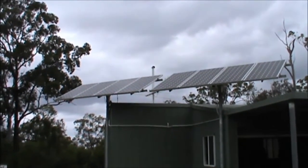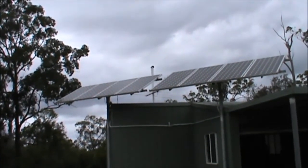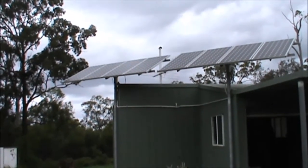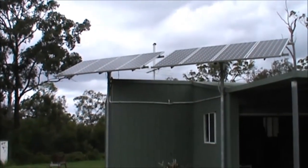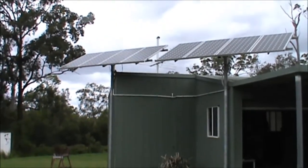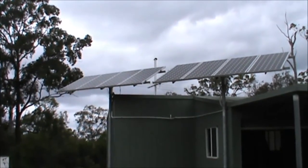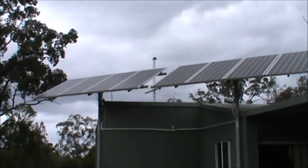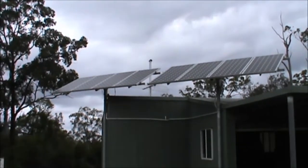You can also see in the background there that it's quite cloudy, and this is a problem with off-grid solar systems — they're not operating at their maximum efficiency. The integration of off-grid power in homesteads means you've got to watch every bit of power you consume with the appliances you're using in your home. In this case John here's got a backup generator; they've had to use it for the last three or four days because we've had rain. On cloudy days like this you will get some charge off the panels but they're not operating at their maximum efficiency.